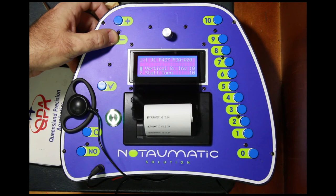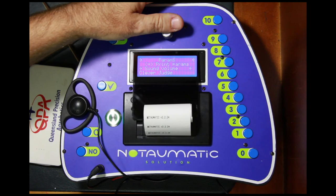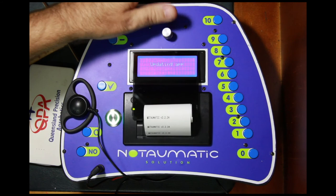Press the minus button to come back to the home screen, because this update is done via the maintenance menu. To get to the maintenance menu, long press the jog wheel — that brings us to the params menu. Then we get to the test menu, and then the maintenance menu. Once in the maintenance menu, use the jog wheel to rotate down through the menu options and you'll see an option for 'update application.'